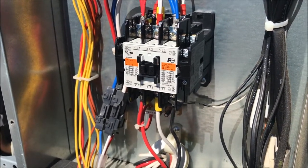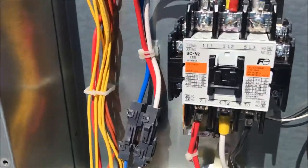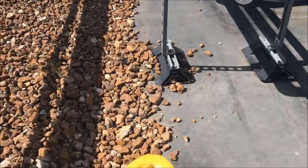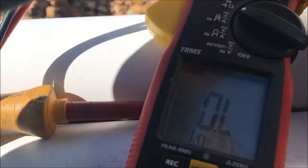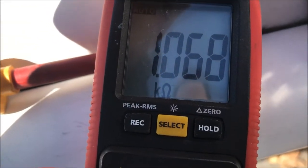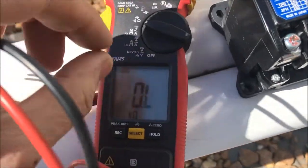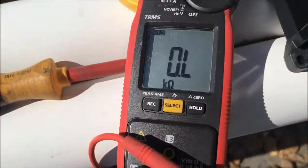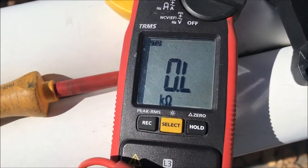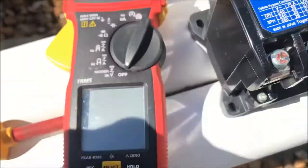I'm not going to say this one's fixed because this is like the third thing that's happened to it in a week, so let's hope this is it. Thanks for watching. Just to verify, we did check the ohms on this winding — the winding was 271 ohms. On this one here you got 1068 ohms, so that was definitely causing our issue. Just wanted to show you on camera what the ohms were on the coil: 1068 on the bad one, 271 on a brand new one.